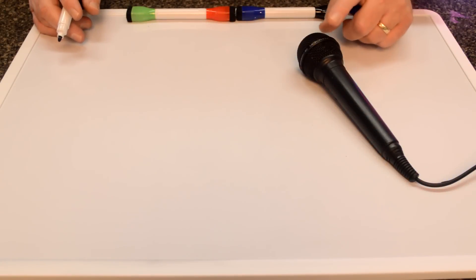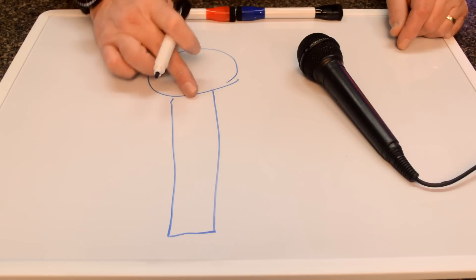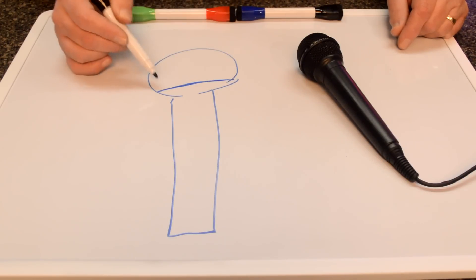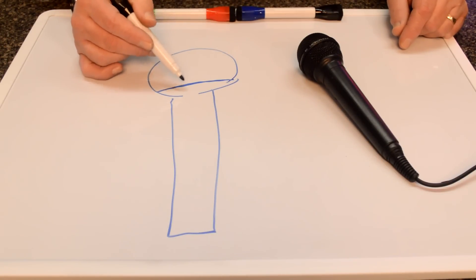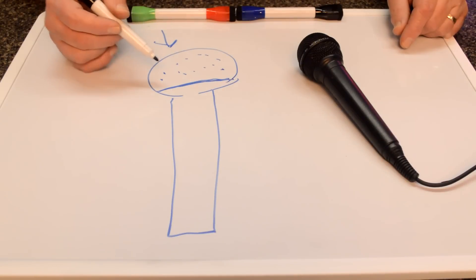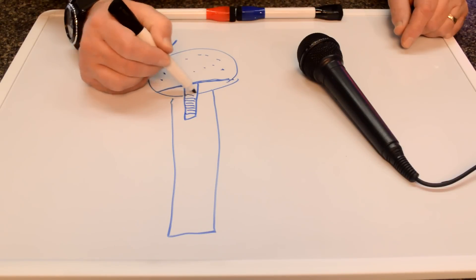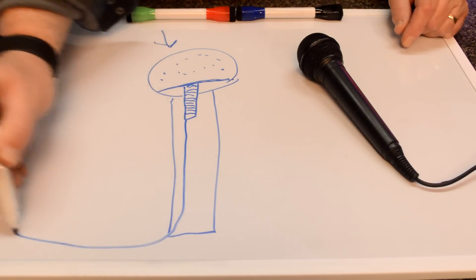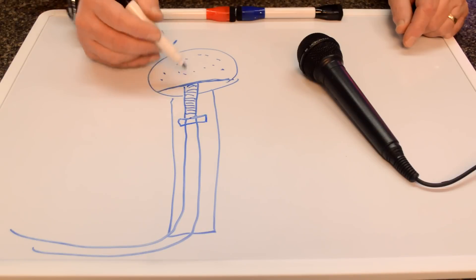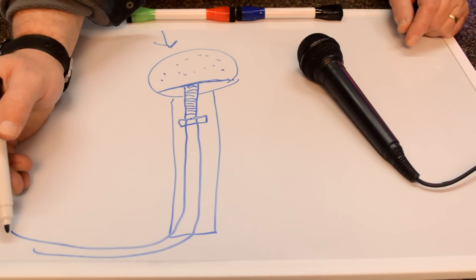Let's go ahead and draw a quick illustration of how this type of microphone would work. Inside this part right here is a piece of plastic, metal, or mylar, and it's allowed to flex — it can move back and forth. When you speak or play music into the microphone, this vibrates. Attached to this membrane is a coil of wire in a tube, made out of copper wire, and there go our leads out to our amplifier. The last component is a magnet that sits right here. When you speak, it makes the coil move back and forth against the magnet, and it allows a small signal to go out to the amplifier.